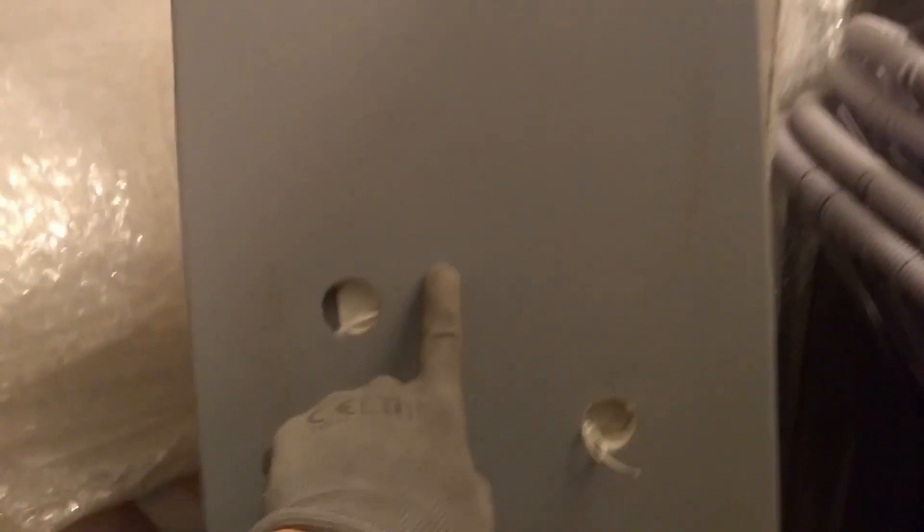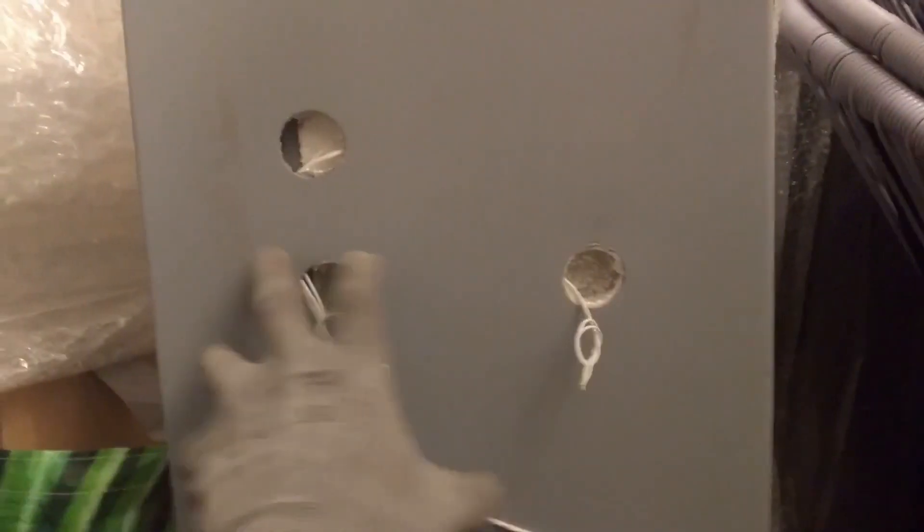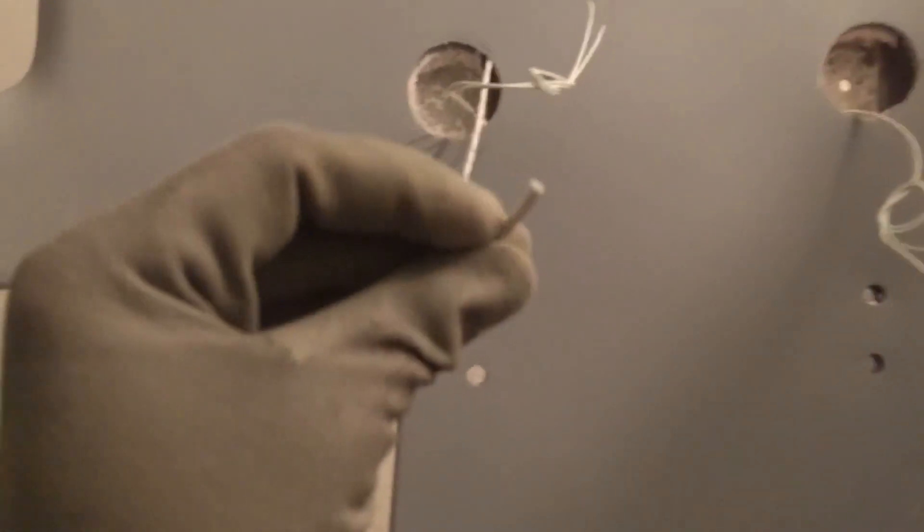That channel runs the whole way and finishes near the hole where the rear seat is supposed to be placed — that's where the corrugated pipe ends. I've taken the wire out to this one and closed off this port. I'll put a channel across here to bring the wire to the other side for the other light. These two will be the front red lights going up there. I went for a twisted 3-core cable through this, just so it's a bit safer, more protected, and noise-free. One mistake was putting a hole through the wrong spot, so I'll have to fill that with epoxy resin.